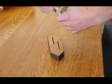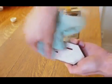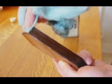Once you've done, you can begin adding some finishing oil, which makes the wood glossy. Don't put too much on at a time, and you'll need to give it at least 5 coats to get it to be shiny. Leave each coat to dry for at least 5 hours before adding the next.